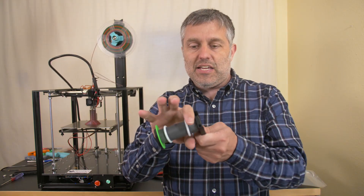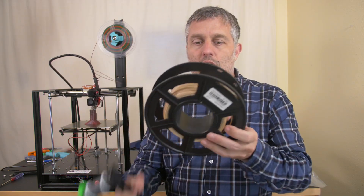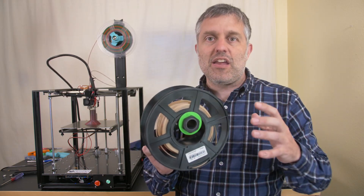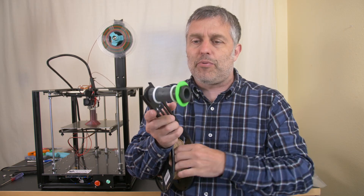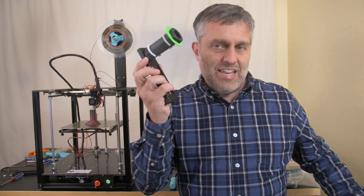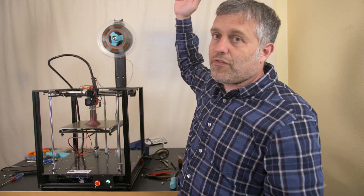I've gotten rid of the old one. Here's an Ender 3 — similar design, just a cylinder the filament spool slides onto. With this spool there are no flanges on the inside, just a flat bottom to the internal hub, which means even more friction. It would wind up and then go clunk, clunk, clunk — that shaking causes weird artifacts in the printer. As a quick fix, I put some wire through lengths of PTFE Bowden tube, which is slippery enough. I've got plenty of hours printing on that design, but the increased flange diameter made it harder to fit smaller spools. Not ideal.